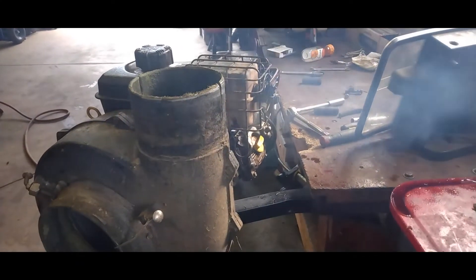Once you clean everything out, you're going to need to let it run for a good five to ten minutes, depending on how bad it was. This one was pretty bad so I let it run closer to ten minutes just to burn all that oil off. It's a pretty simple fix, just time consuming - clean out the carburetor, get all the oil out of the head, put it all back together and let it run. It's going to smoke for a little bit, but if you're having that problem, the machine was likely tipped upside down or on its side. Hopefully this helps - hit subscribe below, give me a like, see you guys next time.